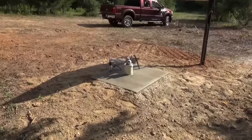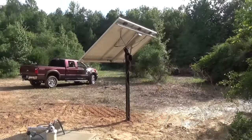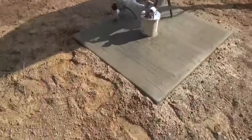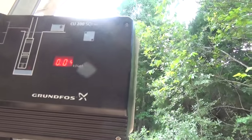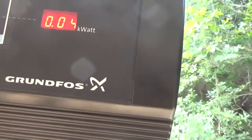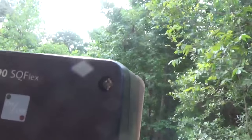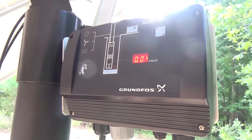We are at the end of day three on this NRCS project and it is pumping wonderfully, performing wonderfully. The pressure switch is now working, turning the controller off. It's almost six o'clock so several solar panels aren't in the sun much now — we're only making 40 watts — but she's still pumping. You can see the green LED; it says the rotor is turning on the Grundfos SQ Flex. Great pumps. When the pressure line is pressurized and the tank is full, this light comes on and you can turn the system on and off.